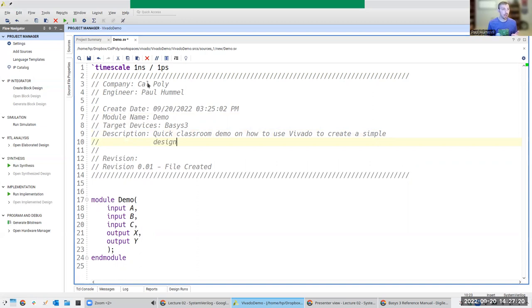So usually it's worthwhile to have this. This becomes very handy as you move on and start making modules that may have different parameters, that may have different limitations or specifications, especially for things like if you have a design that starts using clocks and clocks are expected to be certain frequencies, or there are ranges of frequencies that work, there's ranges of inputs. Usually this description becomes more and more useful.